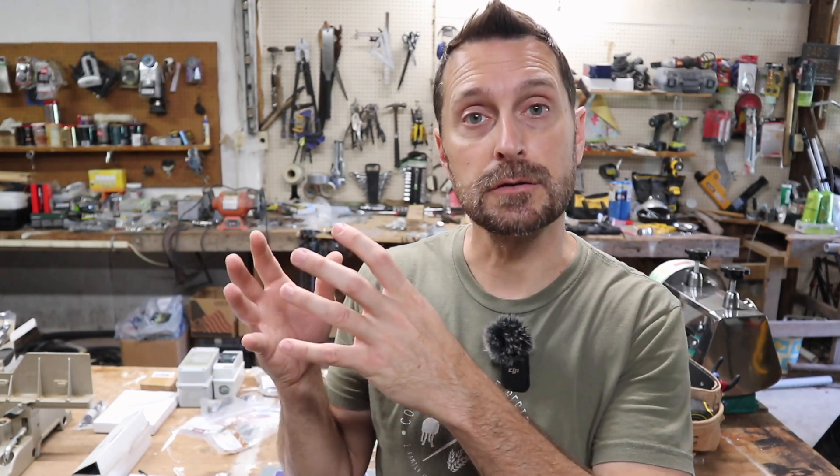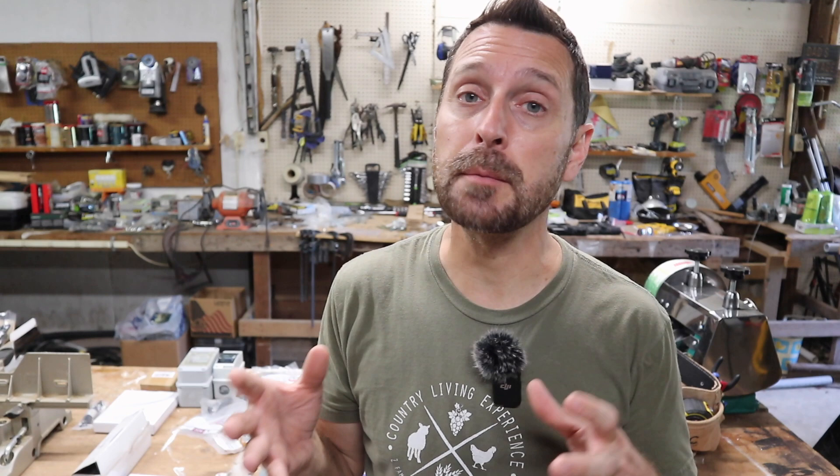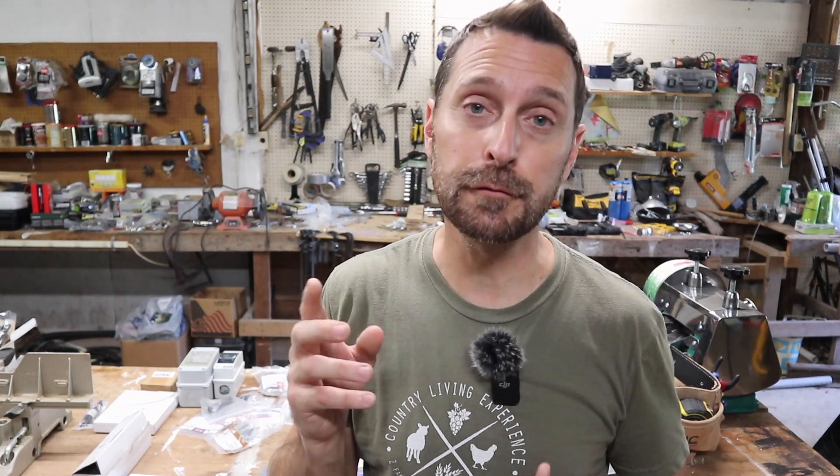Before I go over all the parts and pieces, I want you to be aware that the solar company that you purchase your equipment from is not going to have everything you need. Mostly everything they're going to sell you is on the DC side of things — directly related to the inverters, the panels, and all of that equipment. But for the AC side, connecting to your house or structure like we are here in the barn, you need to find and purchase all of that material. Additionally, there are going to be parts on the DC side that your solar supply house is not going to have, including small breakers, connectors, etc. Signature Solar is the one I work with and they have a lot of those little parts and pieces already at their warehouse, but remember that's only for the DC side.